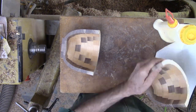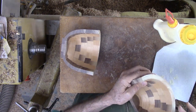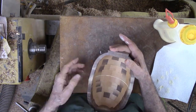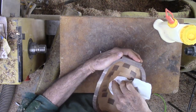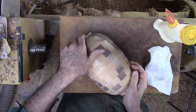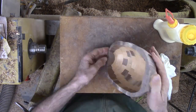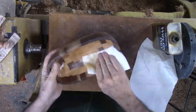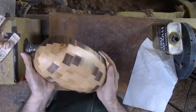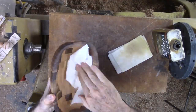If this were a solid bowl and the joint was end grain, then I would worry about joint strength. Following this, I did a lot of sanding with a two-inch pad mounted to the drill press to smooth out the joint between the two halves and the half tenon at both ends. This completes my oval bowl. I am very happy with how it turned out — I did not have to purchase an oval jig to have a beautiful bowl.